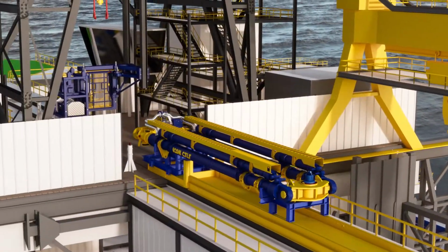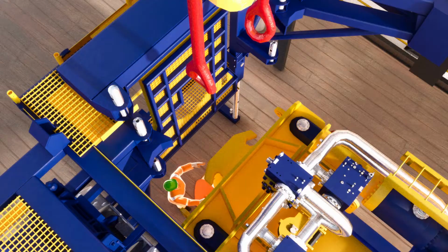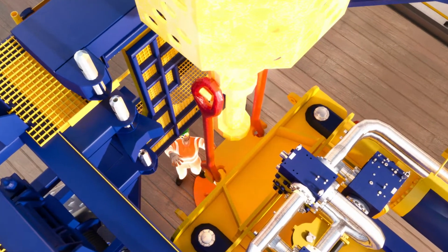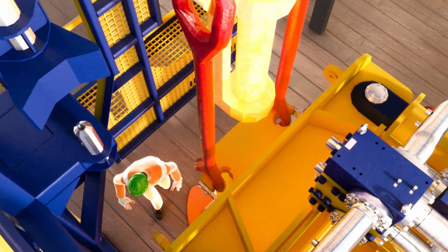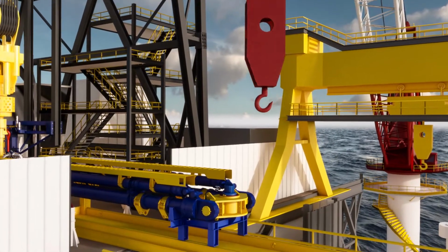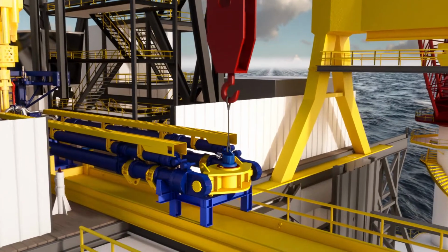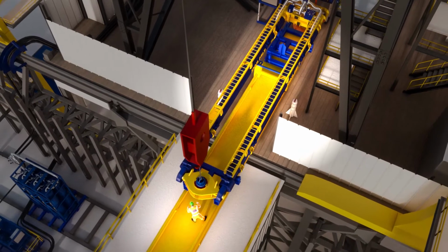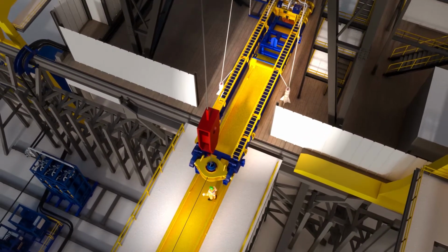The riser skate is driven forward until the head of the CTLF is at well center. At this stage, the CTLF's upper spreader beam is connected to the rig's top drive via standard elevator links, with keeper plates to lock them in place. The starboard crane can then be reconnected to the CTLF via a single-leg sling attached to the lift sub in the lower spreader beam. The catwalk tugger and drill floor tuggers are also connected in a specific arrangement to help stabilize the CTLF during the next lift.